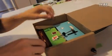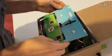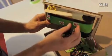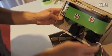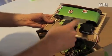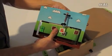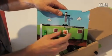We can look inside here to see what's really going on. You can see it's a scrolling wheel that has all of these characters on the level. Each of these is actually a magnet — just a piece of magnetic tape with the bad guy on it. There's one servo here, a continuous rotation servo, that spins the background. Then the little arm up front is a servo that moves your character up and down. It's actually just a piece of like a soda straw with a magnetic sensor.